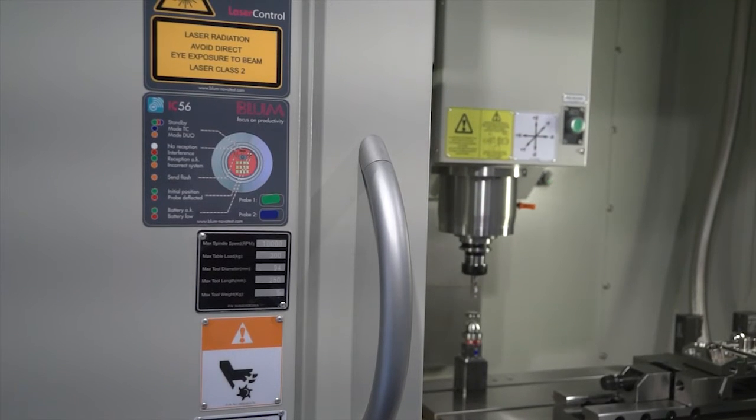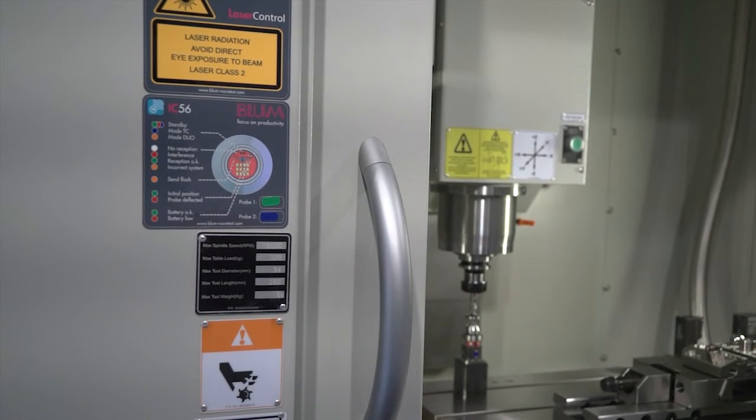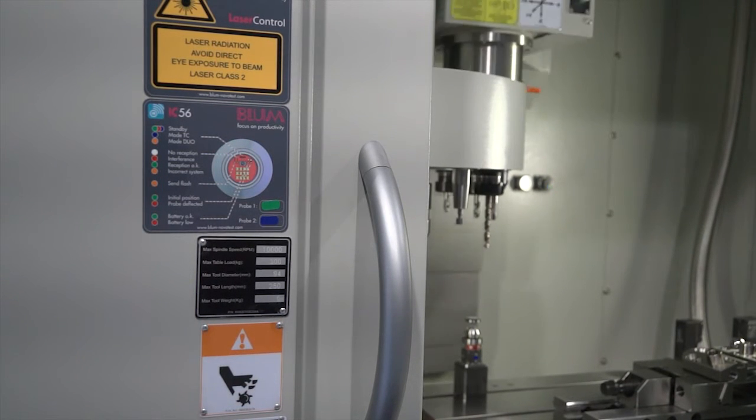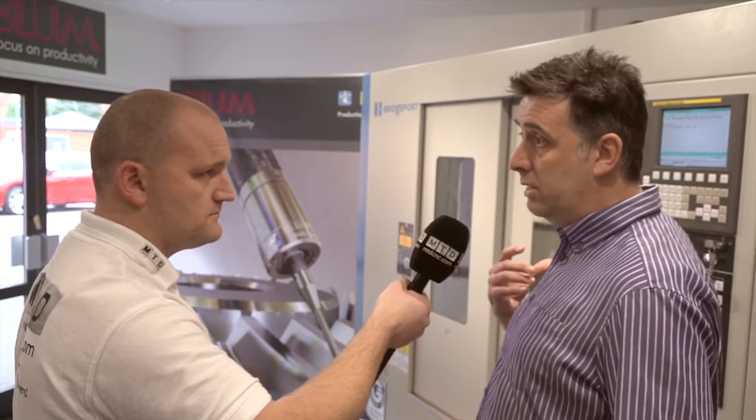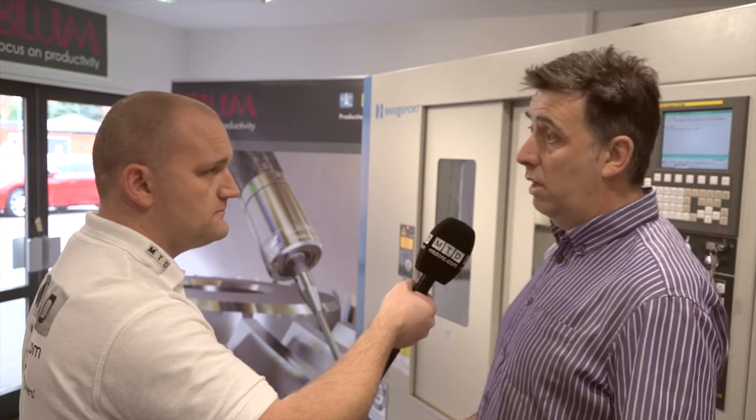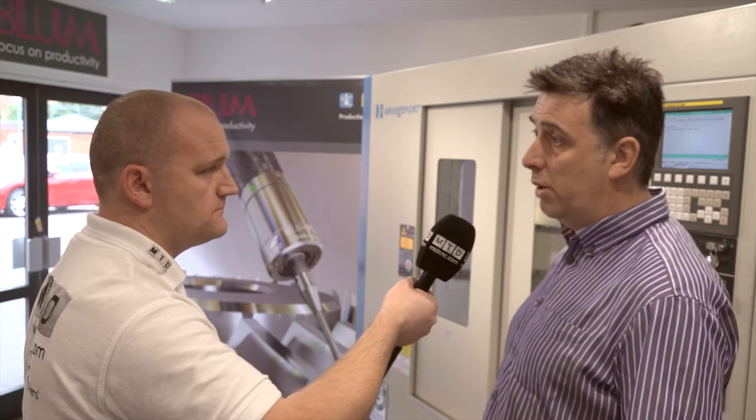So I can inspect a radius on an end mill — can I do it on an indexable product? Yes. The software is programmed to allow various different types of cutting tools, so it's fairly flexible. So pretty much everything I could do on an external pre-setter? Yes. The advantage is that with a pre-setter you can accurately set the tool data, but then you need to get it into the machine either through a network or the operator programming it in by hand, adding the potential for human error. By doing it on the machine, it automatically updates the tool offset files, eliminating any potential misprogramming.